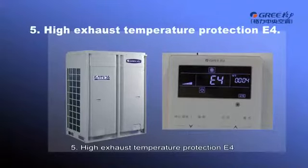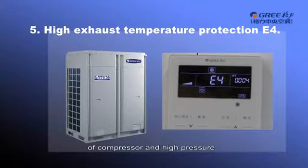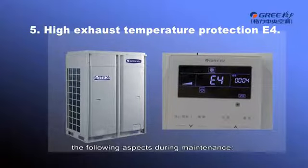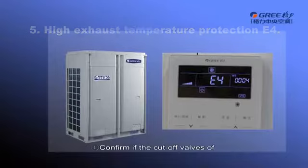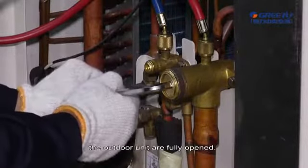5. High exhaust temperature protection, E4. E4 is mainly caused by insufficient suction volume of the compressor and high pressure. Therefore, please check and solve the problem from the following aspects during maintenance. First, confirm if the cut-off valves of outdoor units are fully opened.